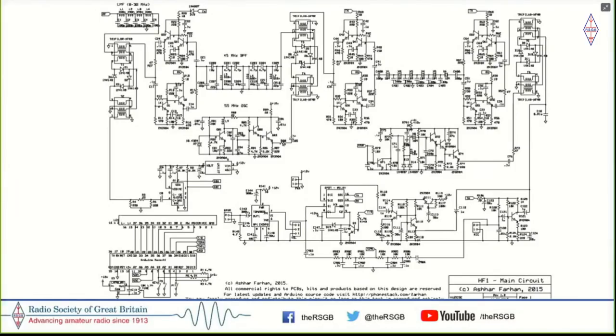This had problems of this 45 megahertz bandpass filter picking up all this other stuff and introducing it back into the circuit diagram. So I could never really get this out the door in a usable format where the spurious signals were within control and within limits. But nevertheless, it gave me a taste of what it is like to build a dual conversion radio.